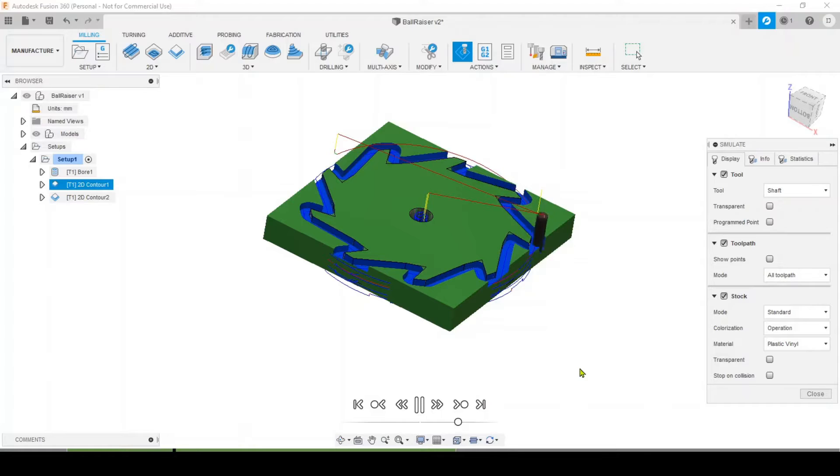I optimized the design to raise the marble and then put together the CAM information just to see that it was machinable. I'm going to set the datum to be the center of the wheel, and it should be straightforward — one cut, one cutter, so no tool changes. Then I can use that to create the profile, cut the outside shape, and cut the hole in the middle. There will be some pieces left which I'll just remove with a chisel because it's easy.